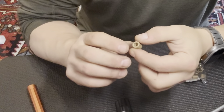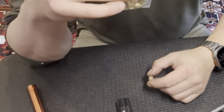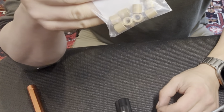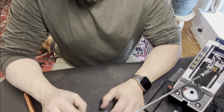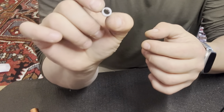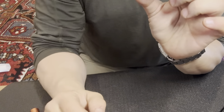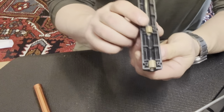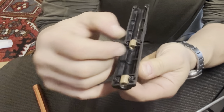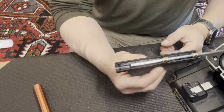What I did was go on Amazon and order these self-lubricating bronze bushings. This whole bag of ten bushings — that's five replacements worth — set me back eight bucks, and I'll provide a link. These measure 10mm outside diameter, 10mm width, and 6mm inside diameter, which is a pretty standard metric size. And they fit perfectly — there's no wobble in this direction, and the rod lines up nicely right through.